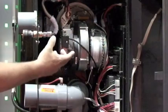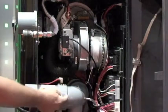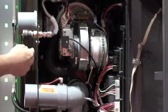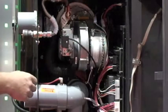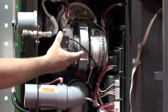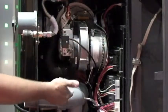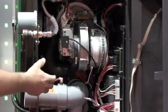And as it travels through the heat exchanger, we come down here through the exhaust, and by the time we come out of this exhaust, the difference between the bottom temperature and the exhaust temperature is within 10 degrees. That's how much energy we're wiping out of that combustion system. So in the main combustion chamber, you can get temperatures in the 1,000 degree, 2,000 degree mark, and by the time you come out of the exhaust, you're basically at the water temperature. That's how efficient the operation is.